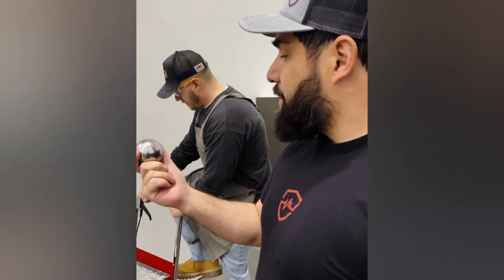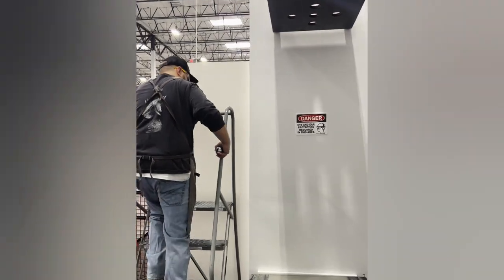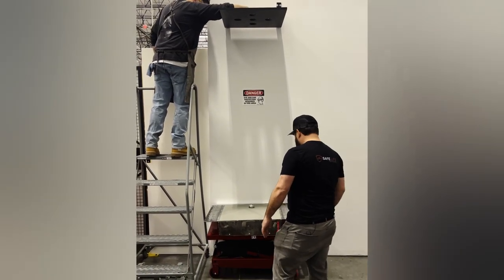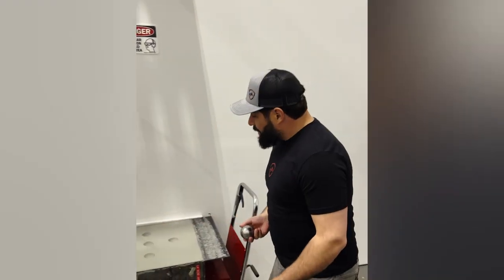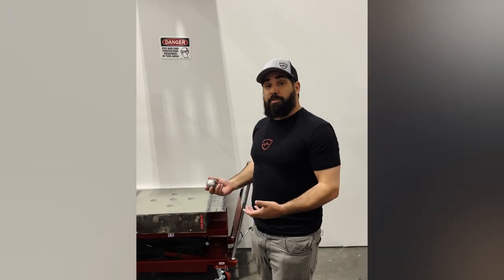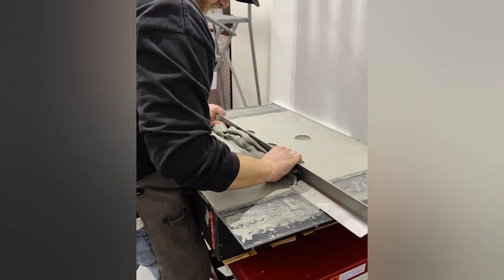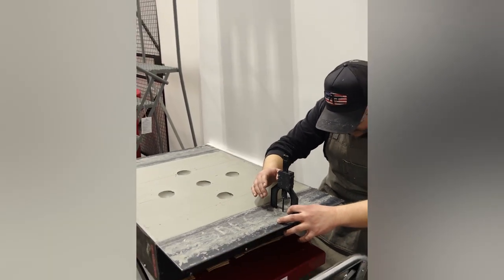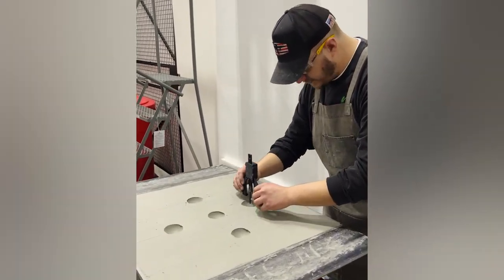This is the very specific NIJ ball bearing. We climb the ladder, drop it from a set distance onto the clay, and repeat that. Next, we're going to level this off and measure the indentation in that clay block. It needs to be 19 millimeters plus or minus two on average to be within spec.